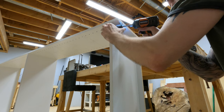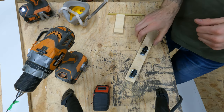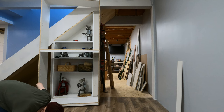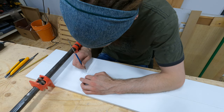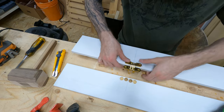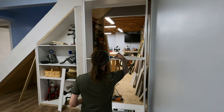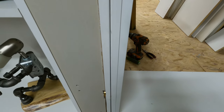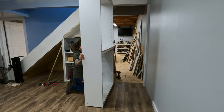It turned out to be about a half an inch out. So I need to pull the entire thing off the wall again, remove the caster, install a piece of half inch plywood, add another wheel for good measure, and pop it back into place. At this point I realized the poplar wasn't going to cut it and I wanted to add another hinge into the middle. So I decided on some 5/8 door jam because I had it laying around. I installed three hinges, put it on the wall, installed the bookcase, leveled it out — and I thought I was good. But as you might have guessed by now, that's not how this build is going to go. Maybe let me know in the comments if you have a better idea than 5/8 door jam.